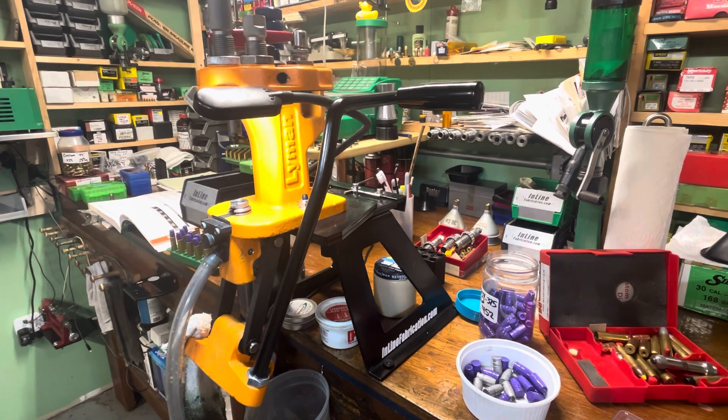We don't have data for this bullet weight — this bullet weighs about 354-355 grains, and of course it will vary based on your casting alloy: the harder the alloy, the lighter the bullet; the softer, the heavier. I need to extrapolate to determine my loads, so this is definitely more advanced reloading. Due to YouTube's regulations I can't show the entire loading process — I'm just showing bullet seating today. The cases are already sized, powder charges are already in, so all we're doing is seating a bullet — one step out of many required to manufacture ammunition.